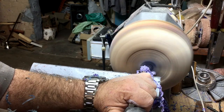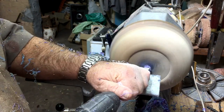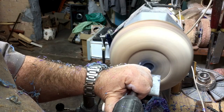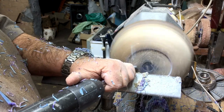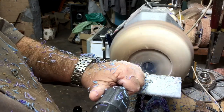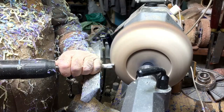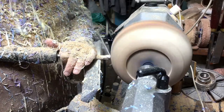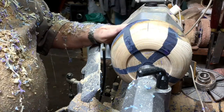I'm squaring it at the bottom, flattening it down, and then creating the space for my logo. Then I'll start working on the corners of the recess base using the v-shape tool from Black Line, going into the corner to create a step so the chuck can grab it better when it opens. I'm increasing the speed and machining it down with the v-shape at a slight angle — you really don't need a lot of sandpaper after that.